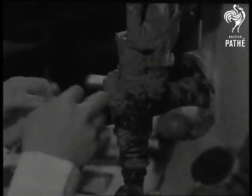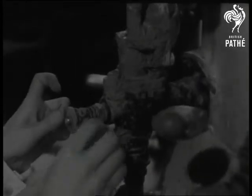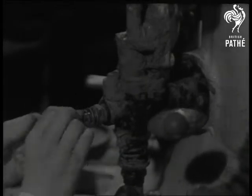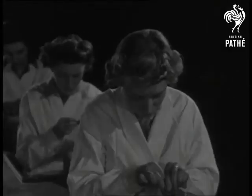Around the bag are wound many layers of rubber tape and thread, all under a very high degree of stretch. The windings make up the hard core and give the ball its resilience, which is reflected in the long flight of the ball off the club. The first few layers are applied by hand, as the unbound center is too soft to be wound by machine. When it is sufficiently rigid, the machine takes over the winding operation.